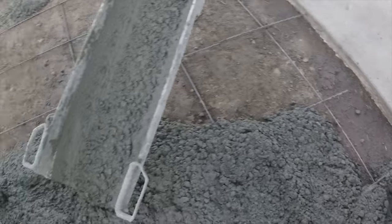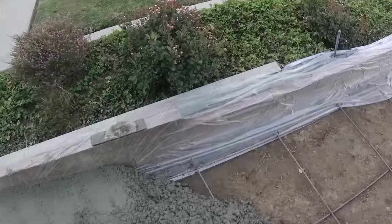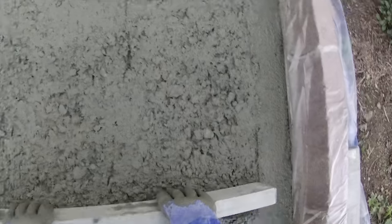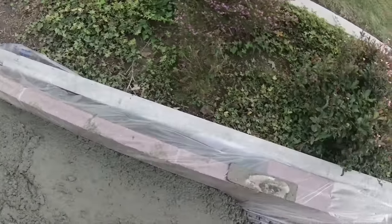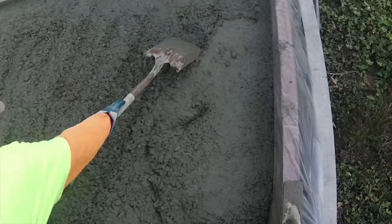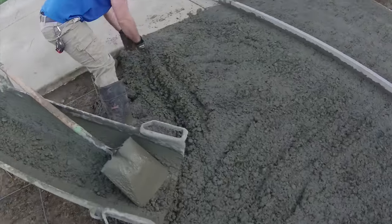You'll notice that plastic there — it's underneath the concrete. The reason I do that is it stays in place much easier than trying to tape the bottom or do other tricky stuff. Just run it wild, throw the concrete on top of the plastic and you're done — it's not going anywhere. This is only 0.25 mil plastic, very flexible, so you won't get any air pockets behind it. In fact, it's so thin that if you hang it on a wall, static electricity will hold it vertically.